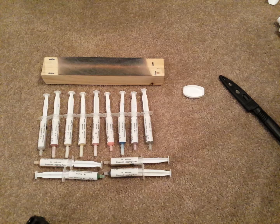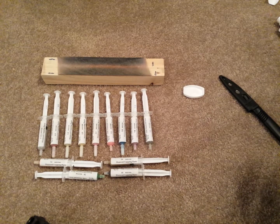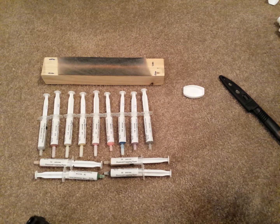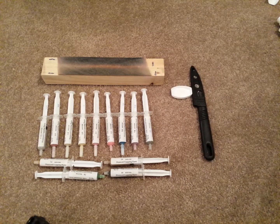I'm bleeding more. So just some food for thought — maybe if you have some diamond paste laying around or some old strops, give it a try. Don't do anything too drastic like mixing quarter micron and 40 micron, because that'll just give you some wacky edges. But if the micron sizes are within about 7 to 10 microns of each other, it should give you a quite nice edge. Thanks for watching, guys. Hopefully this video quality comes out much better than my previous ones, and I will see you soon.